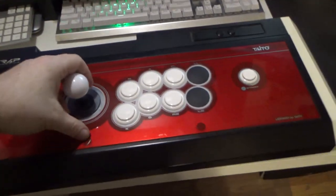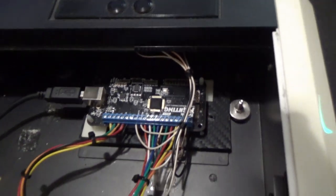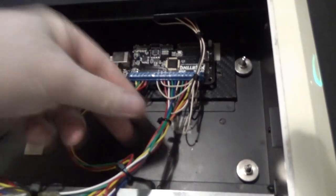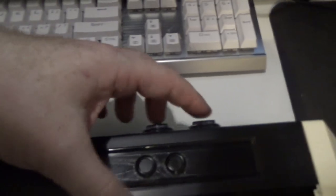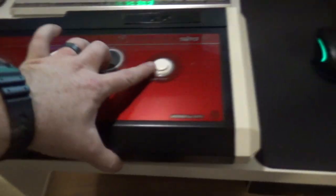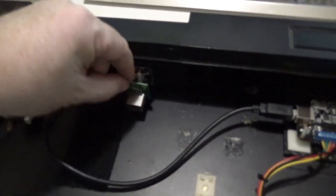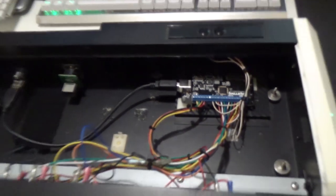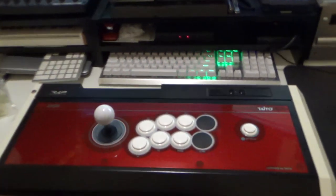So we have just finished putting the Brook in here. We'll go ahead and open this up and kind of check it out. Here's the Brook sitting where the old MC Cthulhu went. To the best of my ability with the tools I have here, I went ahead and zip-tied everything so it doesn't move too much. I have two buttons here — this is the home button, this is the select button. Two buttons in the back for a four-punch and a four-kick. And then we have our six face buttons, our JLF there, and our start button. So that's pretty much it for the VLX — it's all pretty much done. I don't have the RJ45 set up yet; I'm going to look into buying the little header thing and running that back to this neutrik here. So this is the USB neutrik, that's the RJ45 — for now it'll just be empty, but we'll look into upgrading that in the future. We're going to plug it in and update its firmware.